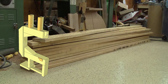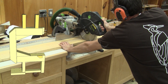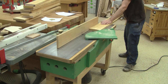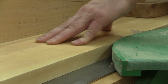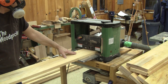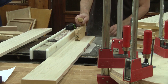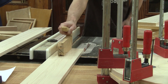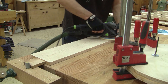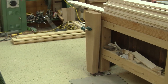Now I can take those maple boards and start working on the frame. The first thing I do is cut a bunch of boards a little bit longer than what I need. When I have a nice pile, I surface them to a thickness of about nineteen millimeters. I also make sure that both sides are parallel to each other. My thickness planer always leaves nasty scratches, so since I want a nice soft surface, I sand each piece. I have all those boards ready and I'll surface those later.